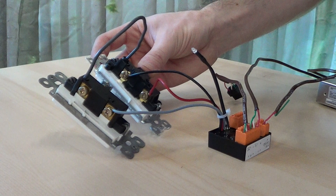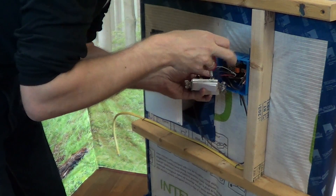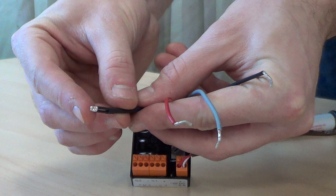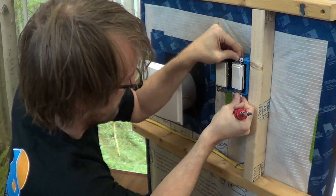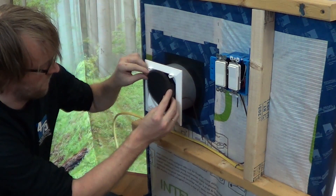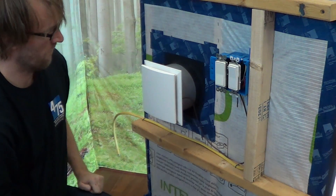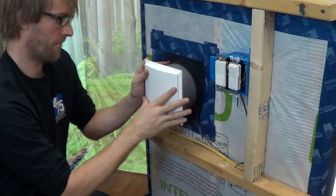Now fit all components of the transformer, controller, and switches into the switch box. The LED filter indicator glows when it's time to clean or change your Lunos E2 filter. You may want to adjust the LED to ensure the glow can be seen through the faceplate after installation. The interior grill simply slides into place, with the removable, cleanable filter resting in a slot just inside. The grill faceplate has two positions: attached upright, the vent is open; flipped upside down and attached, the vent is closed.